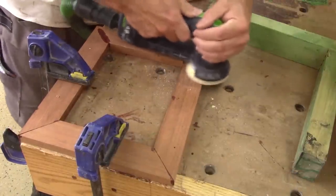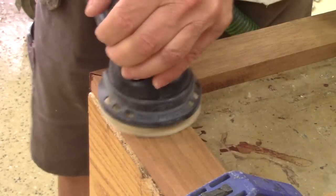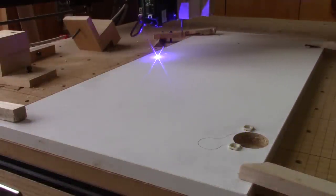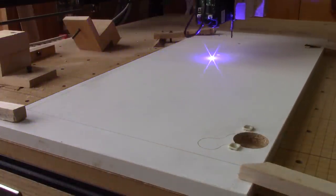When it is, I sand the excess glue. But the glue won't be enough to keep this joint together by itself. So I will add four dog bone shapes at the back of the frame. Before cutting pockets in my nice wood, I'll laser draw what I want to cut out first.